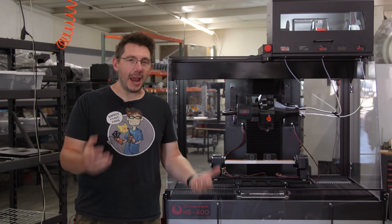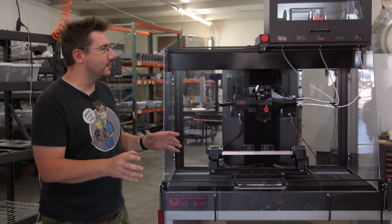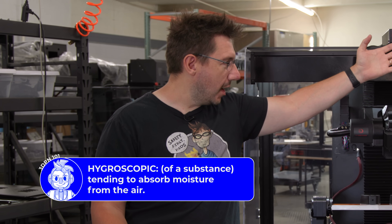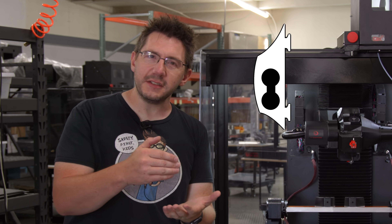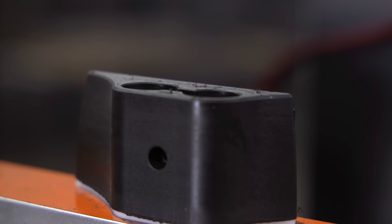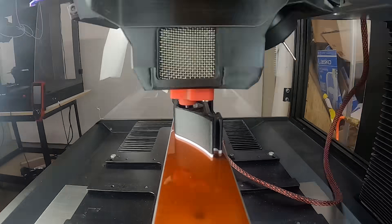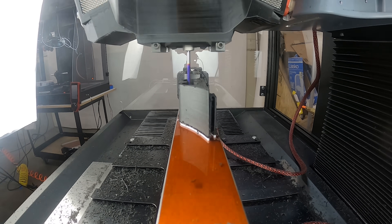Next up on the H5-400 is this hybrid setup, and this is probably one of my favorite things ever. We've got the active desiccating cabinet and that's holding our CF nylon. Nylon is hygroscopic, which comes into play keeping it nice and dry. We're printing it through a carbide nozzle — it's 0.8 millimeters in diameter and we're using 0.4 millimeter layers. We're going to over-extrude just a little bit, which is going to impart more strength to it and allow us to then utilize a milling operation to bring it more into spec. At the bottom is a TPU boot, almost like a TPU raft. That's going to give good part adhesion to the build surface so you're not going to have lifting in the corners. That TPU also raises your nylon parts slightly higher, which means that once the turret changes to a milling tool head, you can mill down to the very bottom of the part without risking damage to your build surface.